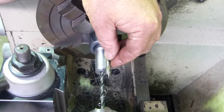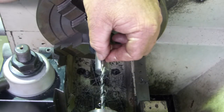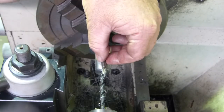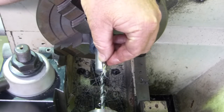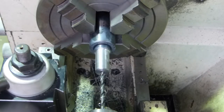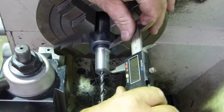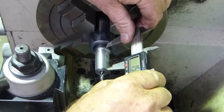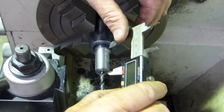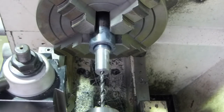A little bit of the front sticking out, really, because on these drills I'm just going to grind a little flat on each of them, so the screw will go halfway. If we go almost to this shoulder here, that still gives us plenty to get it out if we need to. So okay, if we call that zero, give ourselves 1.4 inch, 37 millimetres we can go. Okay.